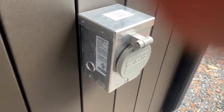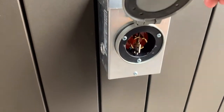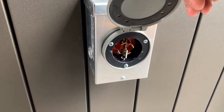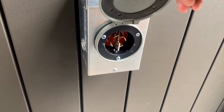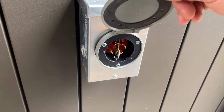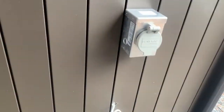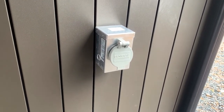This is where you would plug your generator in. It is a four-wire single-phase outlet, rated for 30 amps with 120/240 volts and ground. This is the cord we would make up that you would plug your generator into during an outage. They're a good product — made by Generac — and we'll put a link in the description below this video.